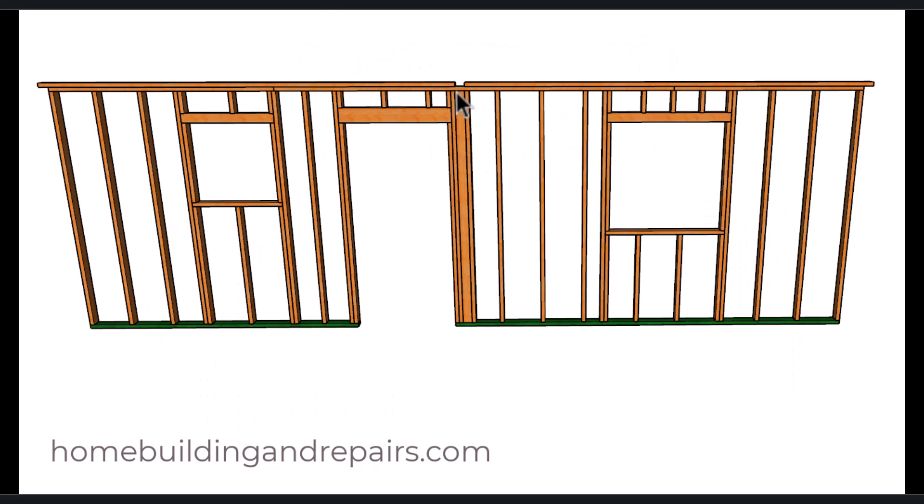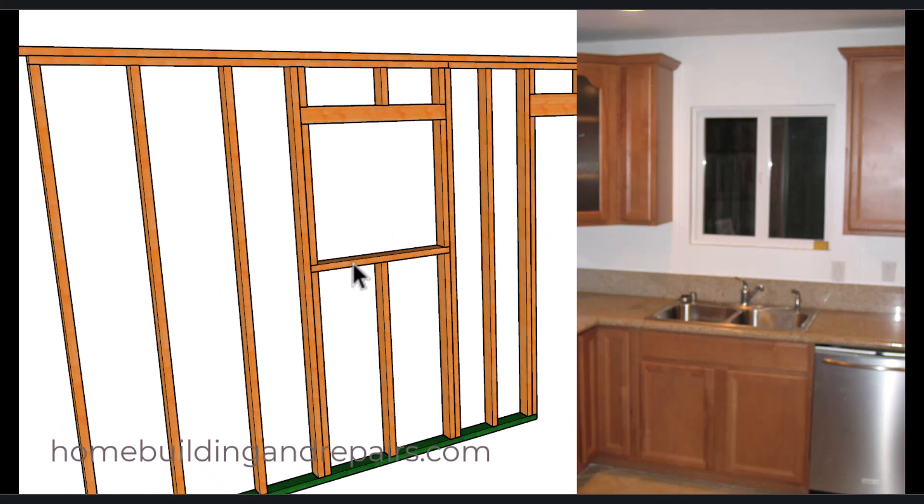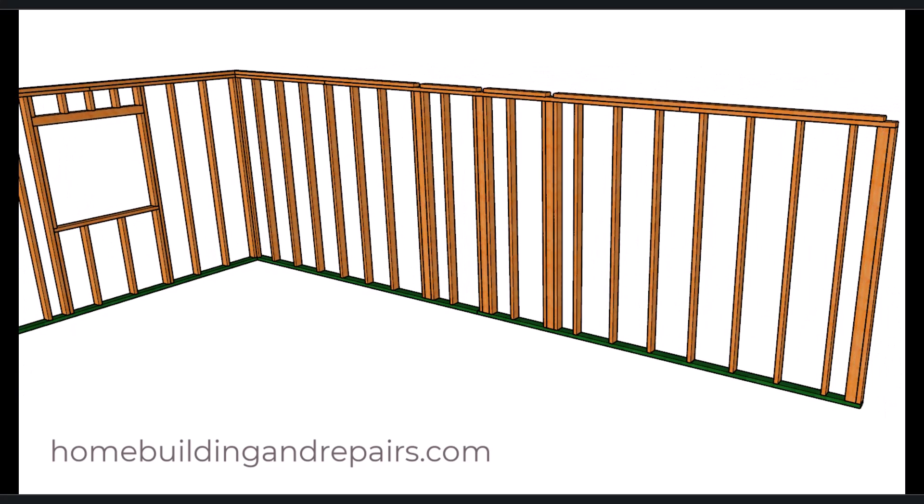Let's head to the back wall where we're going to have a smaller wall here in the kitchen, and that's going to provide us with a little more room for the countertop and its backsplash. This is definitely something you should spend a little more time on when you're designing it — do not let that become a mistake when you're building your project. I've seen it happen more than once. This wall right here, even though it's going to be the same length as the opposite wall, is going to have three channels in it for the intersecting walls that will be connecting to it.